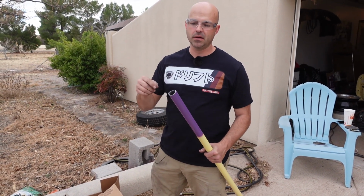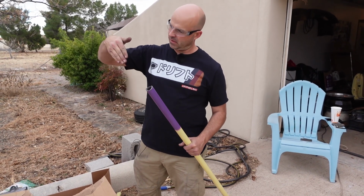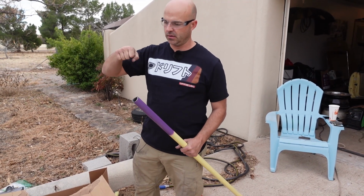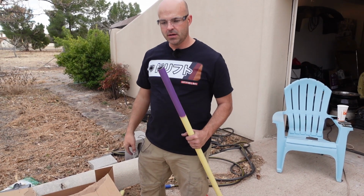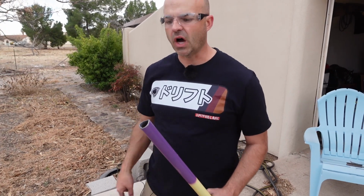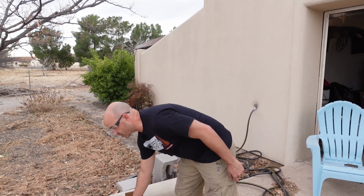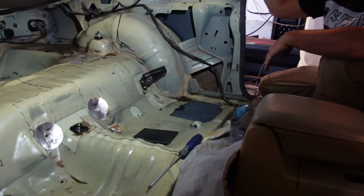But they make tubing notchers, which is like a little angular thing. You put a hole saw in your own drill, and you just run it through, and the hole saw cuts right through. You're just cutting the end of the pipe, not through the whole thing. It's so interesting, a tubing notcher. Anyway, the ones that I saw online are like $150 and up.